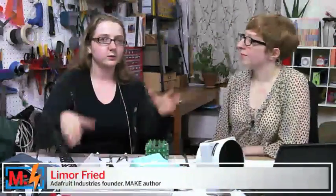We figured we'd start with the easiest through-hole soldering. Through-hole soldering is when you have parts that have legs, and the legs stick through the circuit board. You have a mechanical connection, which makes it really easy to solder. Whereas with surface mount, the part floats and sits on top of a flat circuit board — a little harder, not just because you lack that mechanical connection, but because the pitch, the distance between pins, can be as little as half a millimeter. Through-hole is usually much larger, a little easier. Get good at it, then move to surface mount.